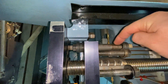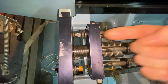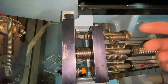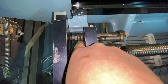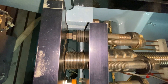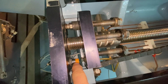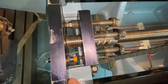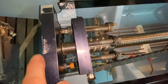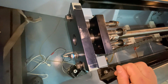This here is the hard stop. If for some reason the machine wants to go any further and doesn't read the switch, this is the hard stop. These are Belleville springs and if I turn the screw by hand you might be able to see them squish a little bit. Hopefully the limit switch will never be crushed - I want it to be triggered before the hard stop touches this block. That's pretty much it for the limit switch.